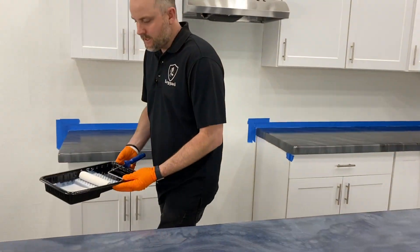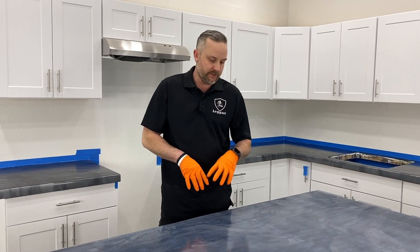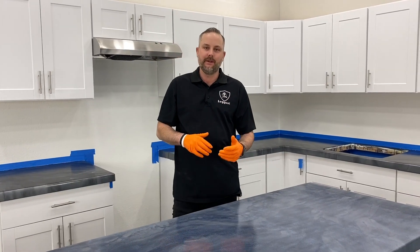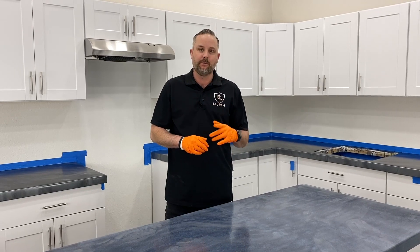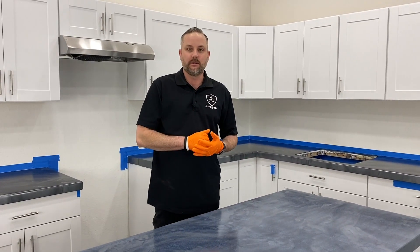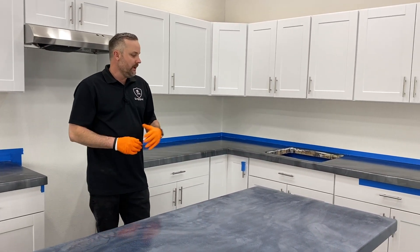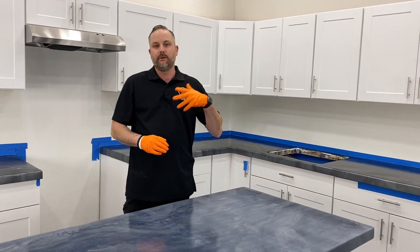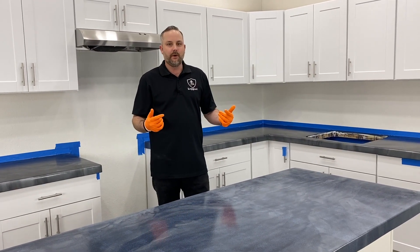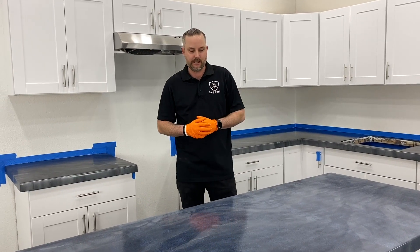Make sure you're double-checking every time you do a section — get different angles, make sure everything's been hit. This goes from gloss to super low sheen. So instead of honing or sanding countertops, you can apply our matte urethane and get that same exact look in just minutes. It's a really cool and extremely popular product. Not only does it add durability and strength, it's also 100% UV stable, protecting those counters from harmful UV rays. As you can see, we didn't drip anywhere and it didn't run off the counter. That's why a lot of contractors will come in after the epoxy coat, come in the next day, peel everything, clean up, run one strip of tape, urethane topcoat it, then peel the tape off when done — they can be finished that day.